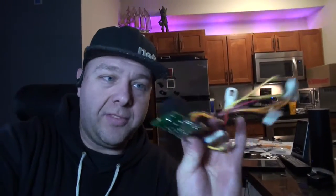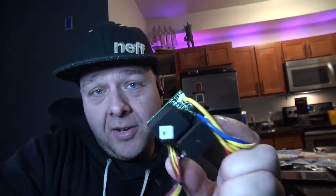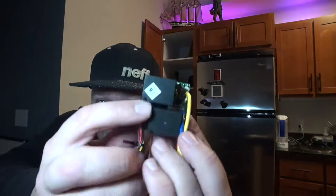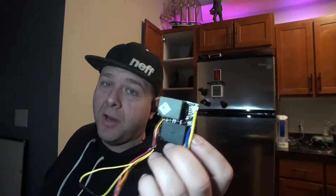What I'm thinking about doing is replacing the motor controller with some relays, and it's interesting because their motor controller is basically all just relays anyway. The only circuitry on here is to inhibit the thing from turning on when the charger's plugged in, and also when you first turn the unit on, it clicks on one relay that connects the motor to the controller. Electric motors, when you spin them by hand, actually generate a small amount of electricity. The controller is powered by the batteries, connects to the motor, and looks for a certain voltage coming back from the motor, which is then used by a couple of tiny transistors to kick on the second relay — and that's when the motor gets powered up with the full 24 volts.